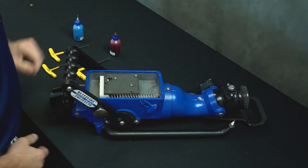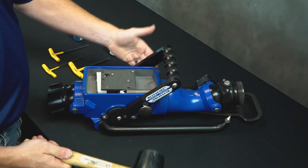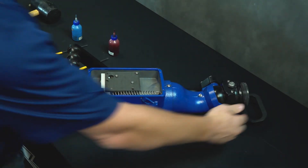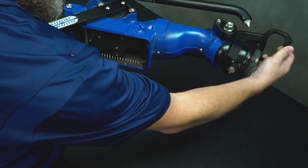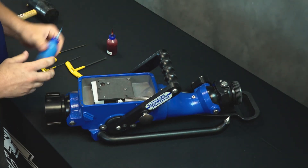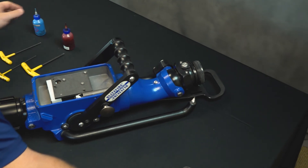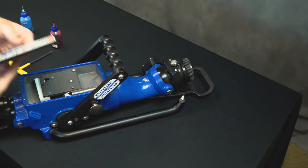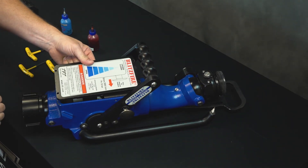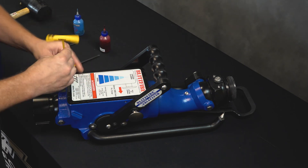Simply open the valve — there are two methods to check it. Open it and using a rubber mallet, tap the side and it should go closed. If you don't have a rubber mallet, turn it 90 degrees on the axis and it should close. If that happens, your work is good. Go ahead and put a little blue Loctite in each of the retaining holes for the lid screws. Then, reusing the lid and screws taken off earlier, put those back on — make sure you're facing the right direction, with the serial number over the female inlet coupling. Using the 1/8 inch Allen wrench, install and snug those screws up.